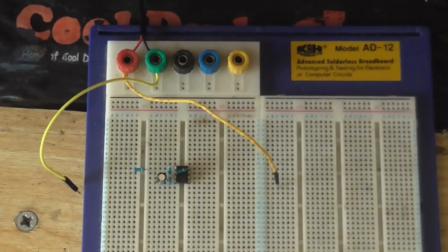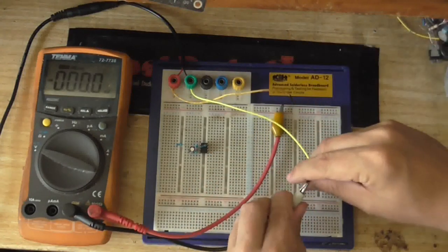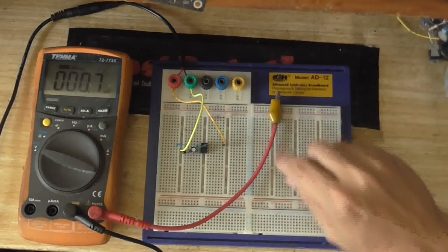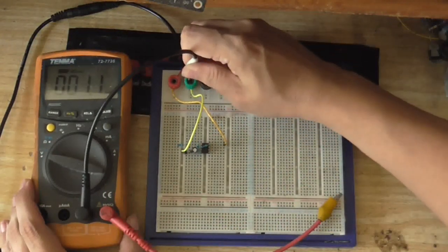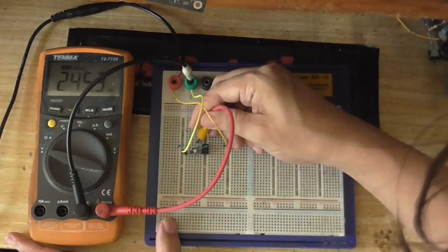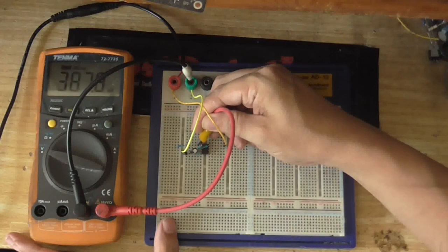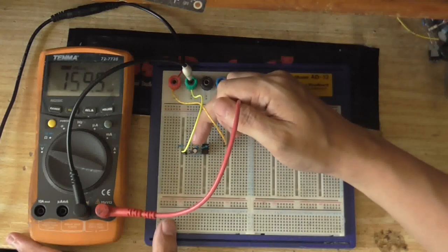I'm trying to do as much of this video while there's still natural light outside, because I don't like having lights on while the sun's still out. I've got a 12-volt supply here. Let's connect that up to the chip. This is a negative wire, so that goes to pin 4. There's a positive, which goes to pin 8, because it is a dual op-amp. I'm going to connect my negative here. Let's see what voltage we've got at the output of the chip — we should have about half of the voltage. And yes we do. We've got about 6 volts there.